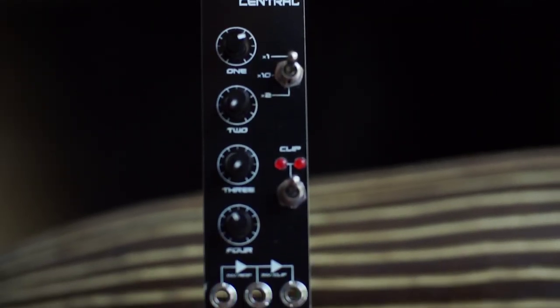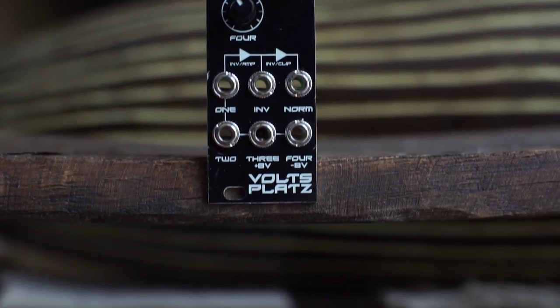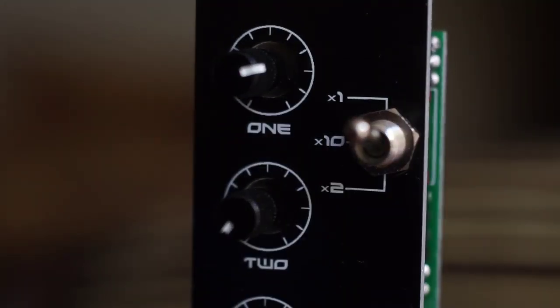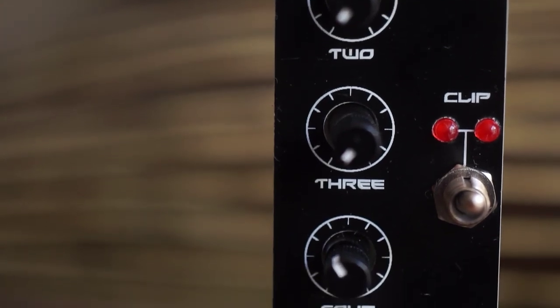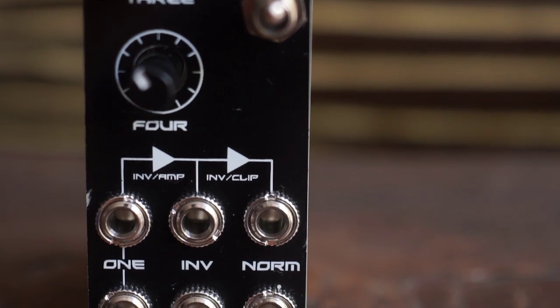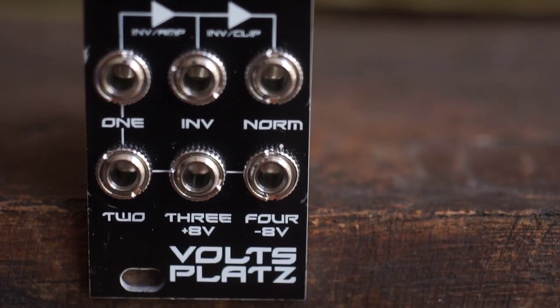This one's a little more work, since you do have to solder the very simple circuit board — no cheating with pre-soldered SMD on this one. Still, it's very simple and quick, and incredibly versatile and useful to have in your system. It's basically a mixer, but through the clever use of amplification stages, LED clipping, and normalizations, you can also use it as a distortion module, a rudimentary wave shaper, an offset generator, or an inverter.